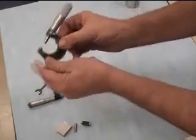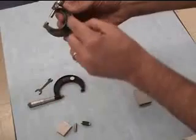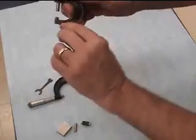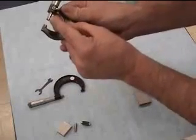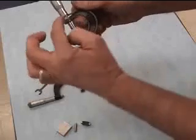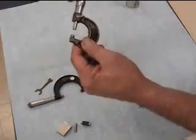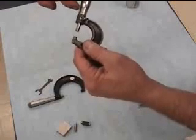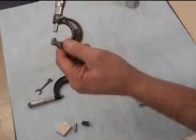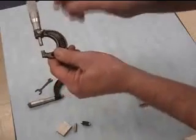This is the standard one-inch micrometer. The frame is here — it's forged alloy steel. It has a fixed anvil with a carbide tip; you can see the dark gray change there. This is the spindle that turns here. This is the lock — it's got a lever lock; some have a ring lock. I see the sleeve or barrel right here, and this is the thimble. The thimble has 25 thousandths on it because it takes 40 revolutions to go one inch.